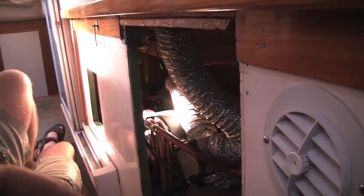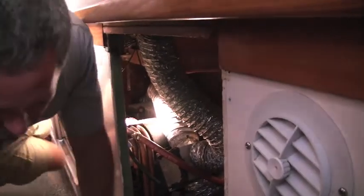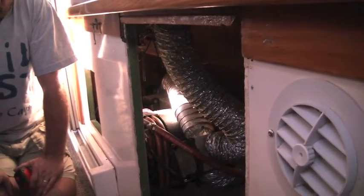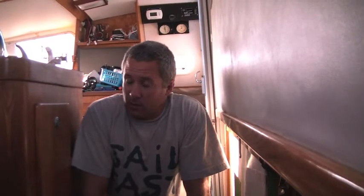It's as cold as it should be and you get a lot more air volume. At 144-volt DC, the main compressor motor draws about 3.8 amps. The total 12-volt consumption — which includes two evaporator fans and the water transfer pump for the condenser coil — drew a total of about 12.6 amps at 12 volts. So our total power consumption to get about 20,000 BTUs of air conditioning was 750 watts. That means on the hook, overnight, based on the planned battery pack, you should have no problem running air conditioning all night long with no noise, except for the compressor kicking on when needed. They're all thermostatically controlled and on demand.